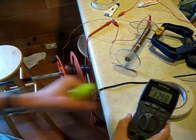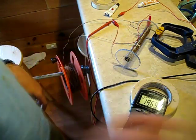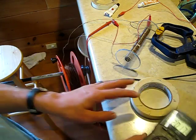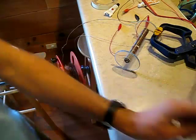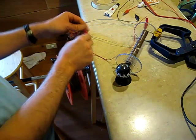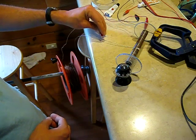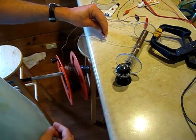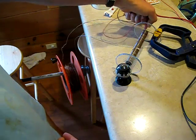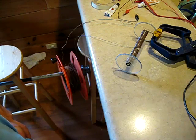You can see the milliamps now rapidly rising up — we're up to 18, and we'll be up to 20 milliamps here, which I predict is two layers. That's on its way up past 20 milliamps. Milliamps aren't really the most important thing about these coils — we are going for electromagnetic effect. So let's get our compass hooked up on this coil and see how we're doing in that respect, because that's what really matters. I'm seeing a lot more swing on that compass. On our second layer, we already have 20 milliamps and we're getting some good action on the compass, which is just going to increase with the layers.